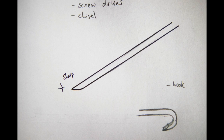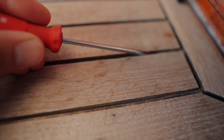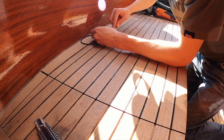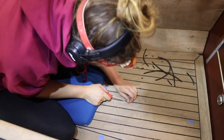You could also make a tool made for pulling the seam out instead of pushing. In the boatyard, we used the end of an old rasp, curved and sharpened like a hook. Now that you've made your own tool, you can push the old caulk out, holding it 45 degrees from the groove. I used the rounded side towards the bottom, not to get caught in the wood and damage it.